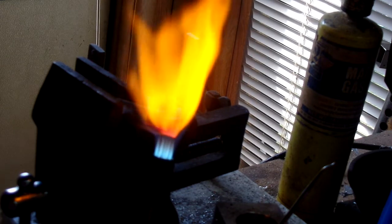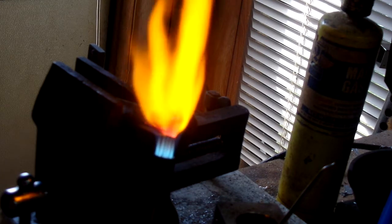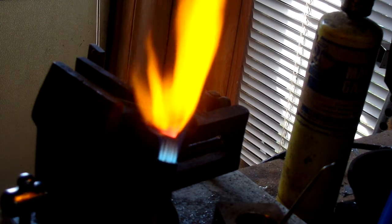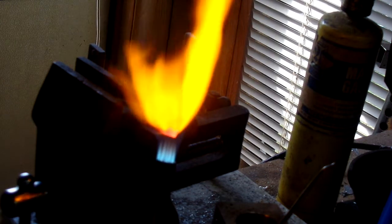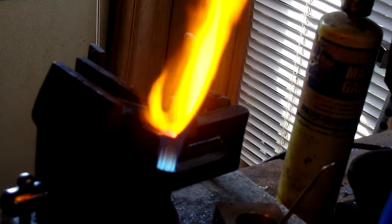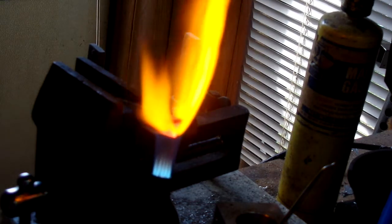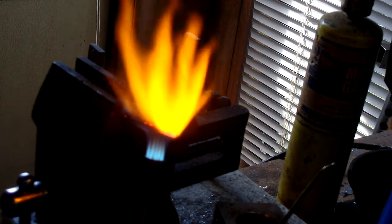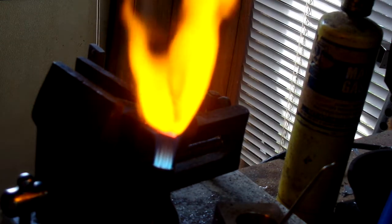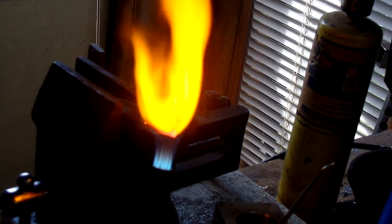Once it all cools off, we'll do some grinding on a green wheel. I like brazing them on. The carbide piece I got was free — it came with my 9x20 lathes. I started out brazing some carbide to tools for my wood turning lathes, and I did some of the screw-insert replaceable inserts.